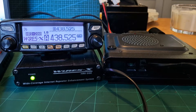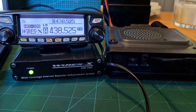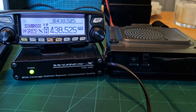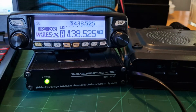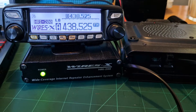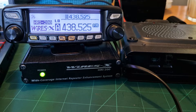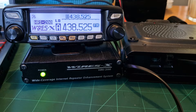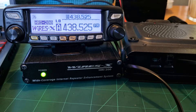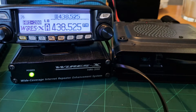Welcome to my channel. We're looking at the Yaesu FTM-100 C4FM VHF/UHF radio and the HRI-200 box. We use the HRI-200 box instead of the SCU-20 cable because it gives us our own room, and we can use it in FM analog quite easily without any additional cables, apart from the 10-pin cable that comes with the HRI-200, which connects on the back of the FTM-100.